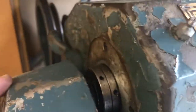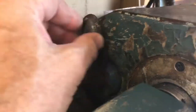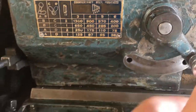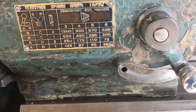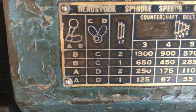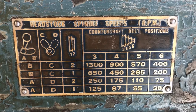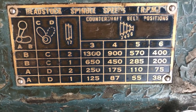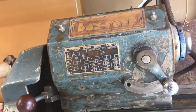You also have an alternative for getting very low speed, called back gear. That's obtained by turning this lever and selecting the back position, and also pulling this lever off to the left side. It goes to that position for back gear, and back to this position for normal speed, giving you a much much lower speed. In the selections labelled A-D you can get down to 38 RPM, whereas in a normal gear position you can get up to 1300 RPM, giving you a big range of speeds.